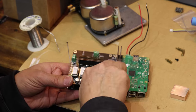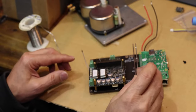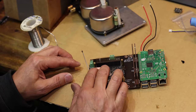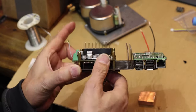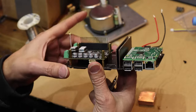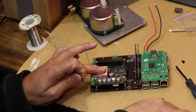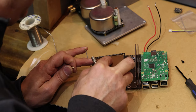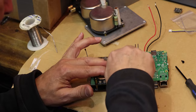We're going to put a couple of standoffs in there. The copper shields are insulated on the inside with electrical tape so you don't get two types of metal touching each other and causing any galvanic problems. I put an extender on the GPIO — it's just a little extension with slightly higher pins. It also has a little sponge to hold them tight so they don't vibrate, because you don't want those clocks moving when you crank the music up.